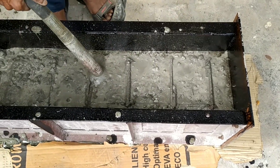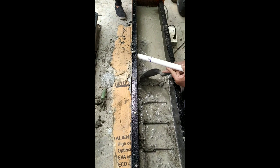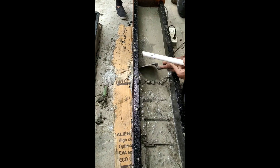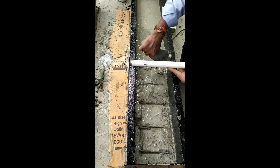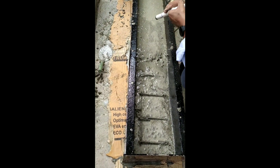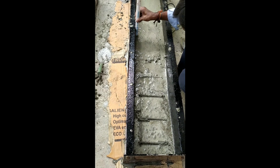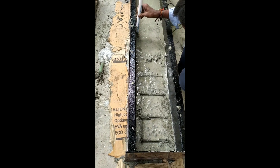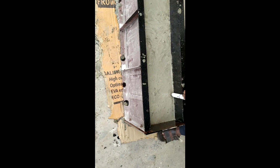The practical range of water-cement ratio ranges from 0.3 to 0.8. With the help of a trowel, we need to finish the top surface of this reinforced concrete beam to achieve a uniform surface. We are measuring the gauge at each section to get the perfect shape of the beam — heights of 15 cm and 23 cm, with length of 1.5 meter for both beams.